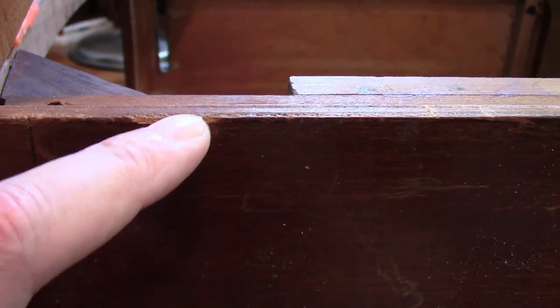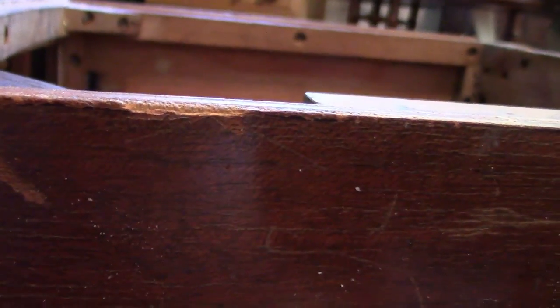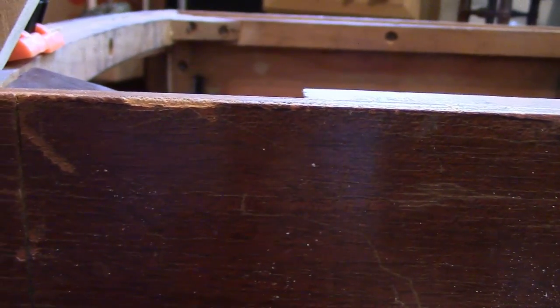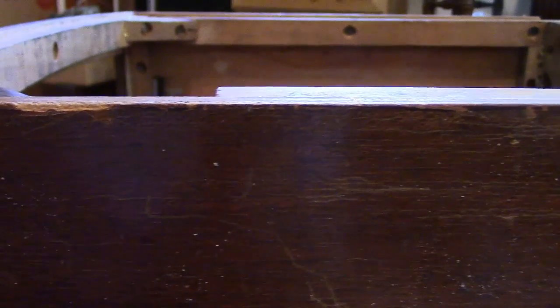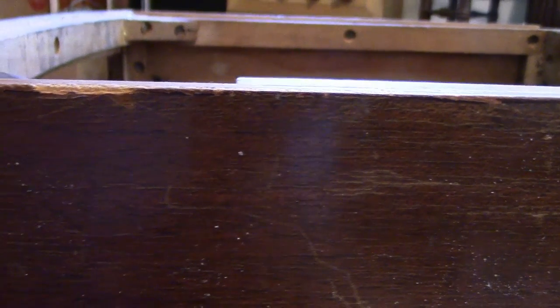So, for example, on just a little chunk out like that, a little bite out, one technique is to use wood filler. Get something that's close in color, maybe use a little stain, and then you can use a knife blade and make little grain lines in it and then fill those pores in with a darker color like the grain filler, and you can get a pretty good approximation of actual wood.